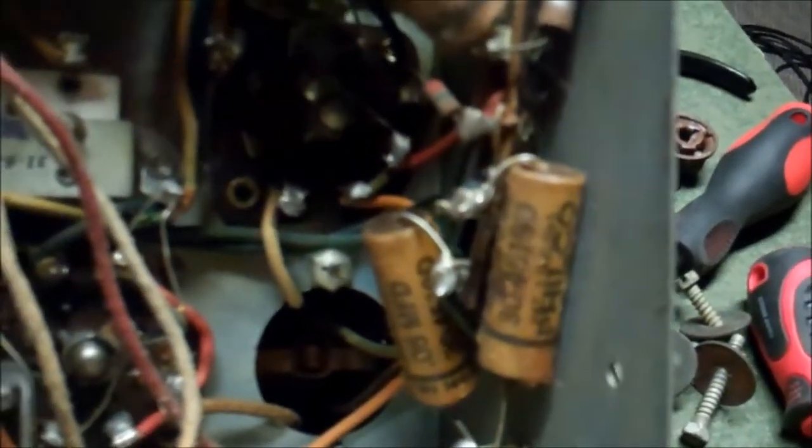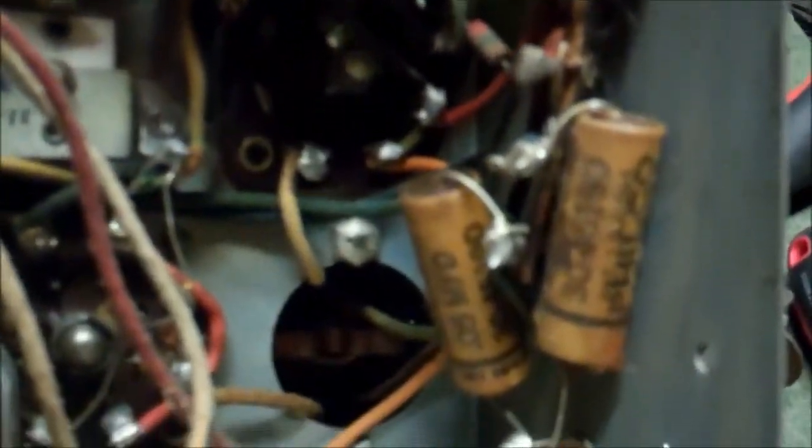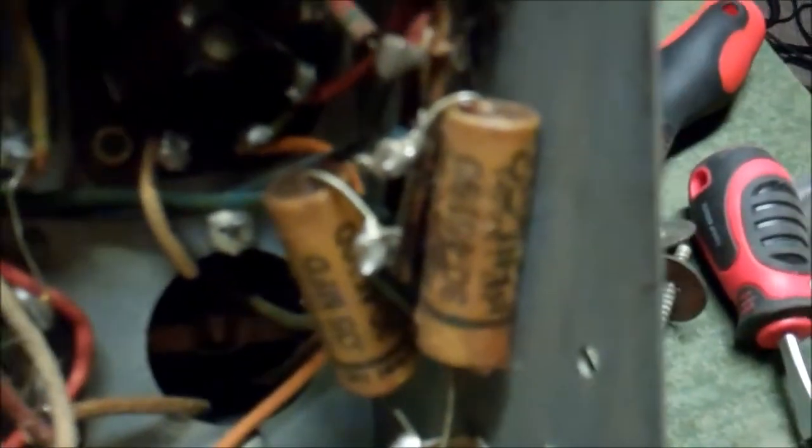Let's get a quick count. We have no idea if these resistors are all even in tolerance, or if the tubes are any good. We've got one cap hiding under there that's going to be a nightmare to get to — I'd have to unbolt all the coils, and all this is soldered on, for one cap under there. That would also need realignment, which I don't have the equipment to do. Counting them up: twelve wax caps that surprisingly don't look that exploded, and then essentially three electrolytics.